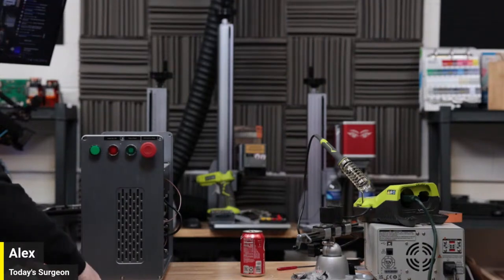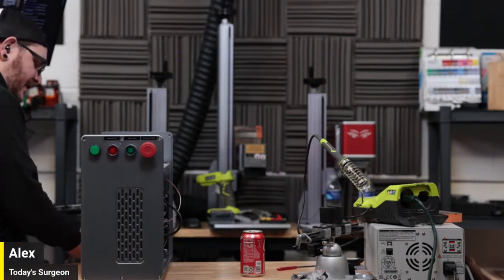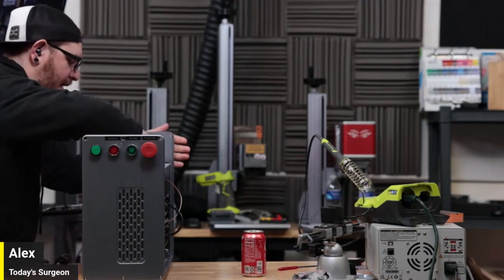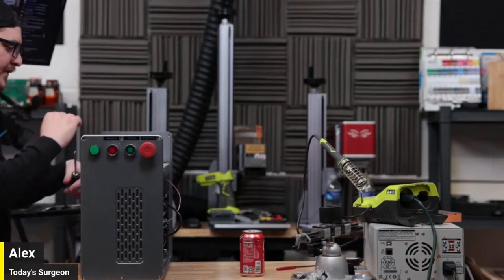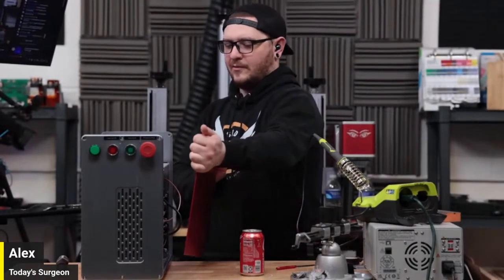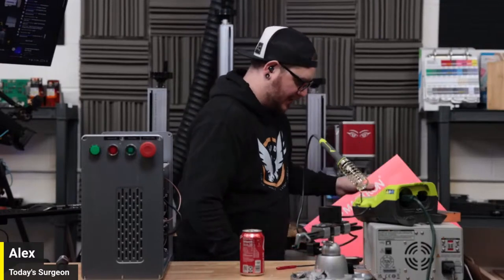No, I told everybody I would have just had to order new cable. They were calling it coax cable, which I guess is what it is. The grounding is like the shielding. I would have just had to buy new coax and rip the whole line out and start it over, which is fine. I was willing to do that. At that point, I had already unwired the source side of the coax, and the laser control card side of the coax. So it would have been just ripping the wire through the shield and doing it again.